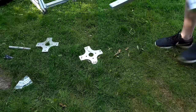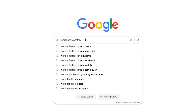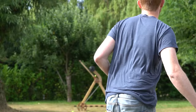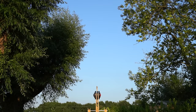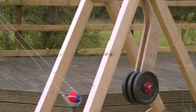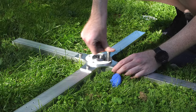The arms are made from 25 by 50 millimeter rectangular tube section, as these need to be strong to survive the huge amount of force accelerating a tennis ball so fast. The official world's fastest tennis serve was 157 miles per hour — my old trebuchet topped out at 124 miles per hour. To beat the record, the 60-gram ball will undergo a centripetal acceleration of at least 265 G's, equivalent to hanging a 27-kilogram weight from the end of the arm, which according to my stress analysis can bend the arm by four millimeters at the tip.